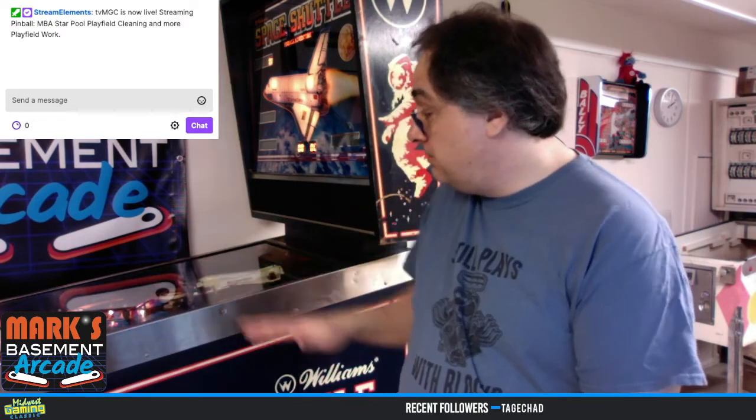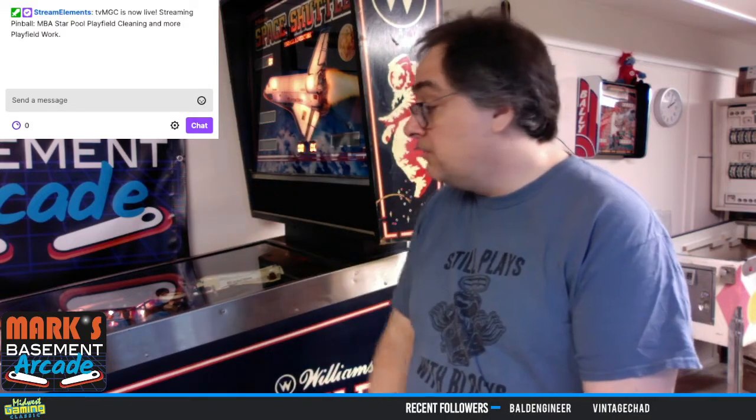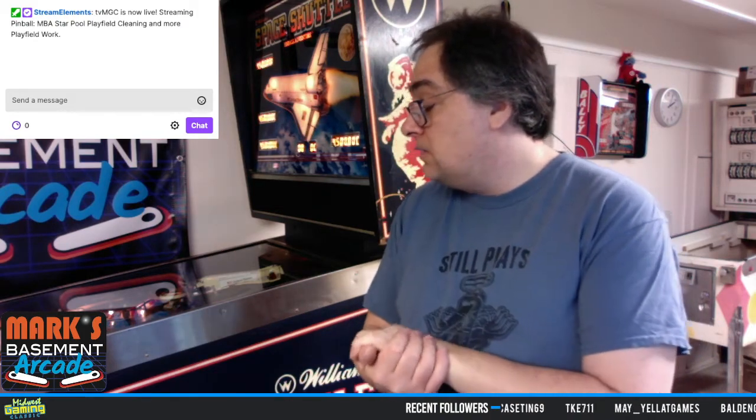I can do everything, hit every shot, and everything does what it needs to. It does the multi-ball, all the cool stuff. What I fixed since I got it Friday, and I've been playing it since Saturday, was a lane guide here that was pushed all the way down to the playfield, so when a ball was caught by the gate or drained or went into the in lane, it did what it wanted. Now it's up high, so the ball has to make a choice. It's either going to go in lane or the out lane. So we got that fixed.